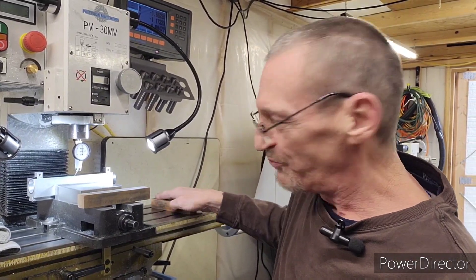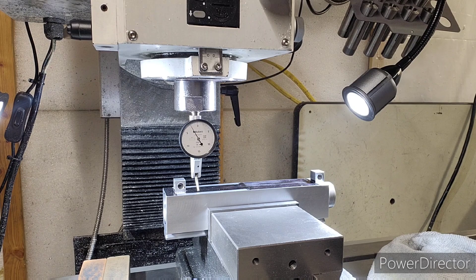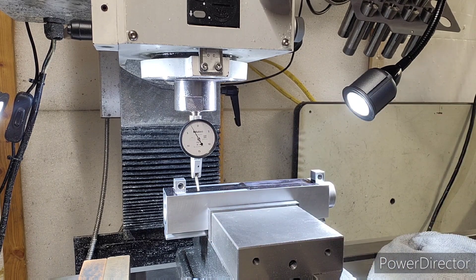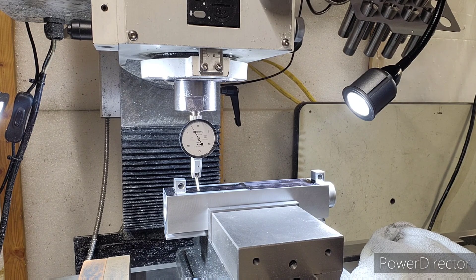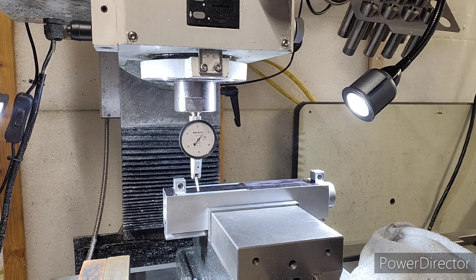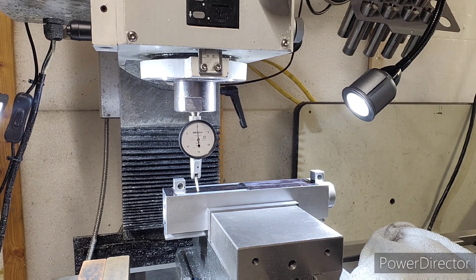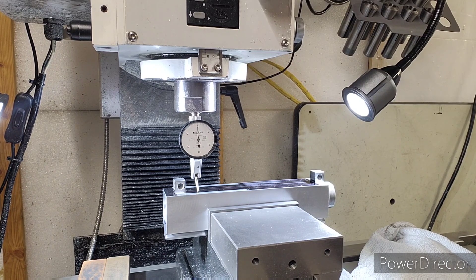Figure eight — and that's it. Enjoy the video. I thought I'd show you how flat my part is in this vise, and we're going to start throwing in details on how I get this to happen. We're going to bring the head down and run that hand right up to zero — just a few thousandths to zero. So that's unloaded. Now we're going to load it to zero right there. I'm going to lightly lock the head. Now I'm going to traverse it and we're going to see with our own eyes that my parts are truly within a half a thousandth.